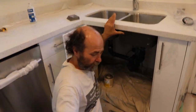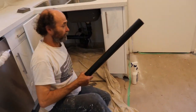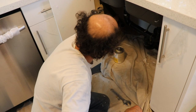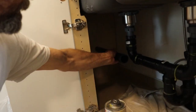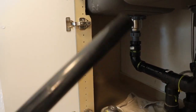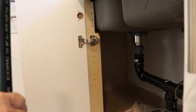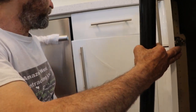It's a little bit different with the way I connected the dishwasher, but it was easy and straightforward — I didn't have to buy an additional hose or anything. Another way I could have done it: if the dishwasher hose was too short, I would have put a T on this pipe and brought the pipe a little bit farther down, then connected the dishwasher. But it was much easier to go to the washroom cabinet — otherwise I would have had to cut through these cabinets.